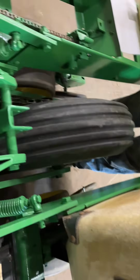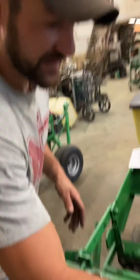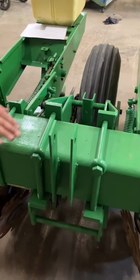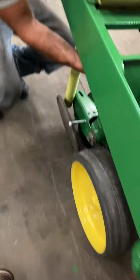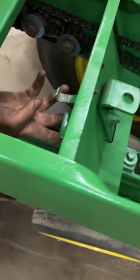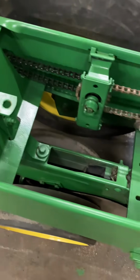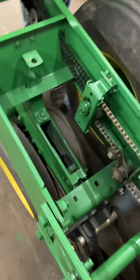Okay, that's pretty much it. I'm going to throw a lot of information at you, like I said before, so you hear everything once. But to recap the important things, when you put it on the tractor, you're going to adjust your center link to level this bar. Just eyeball it, it's just fine. Your seed depth is going to be your most common adjustment. Back is deep, forward is shallow. Those 2 things are the most important things to worry about: level and figure out the depth.